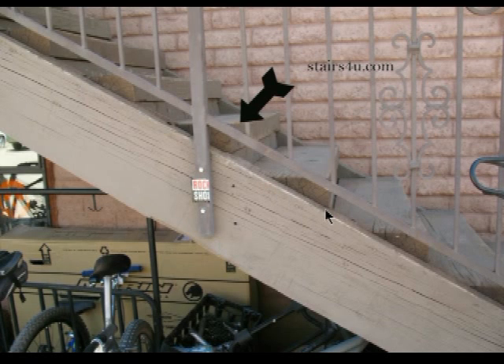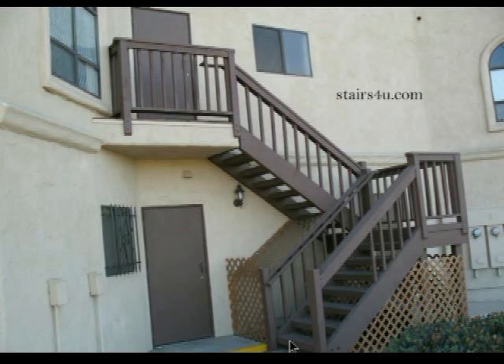First thing I'd like to point out is I'm sure this stairway is going to last for a long time. However, this isn't the norm. Normally, the stair treads are going to be back or centered in between the stringer. That would be the horizontal line or the level line on the stringer, or the top of the stair tread — simply center them in between that area and you will be fine.